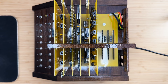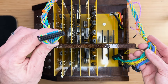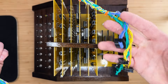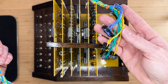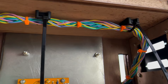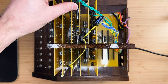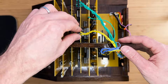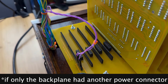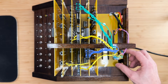The last step is to hook up the switchboard with the connections on the computer. Although I initially considered building an interface board, for now I created a harness using 28-gauge color-coded wires. These wires are very flimsy, so I installed a thick metal wire in the middle to create rigidity. Run the 24-position connector to the inside of the enclosure and connect it to the switch panel; mount it to the side of the enclosure to keep it secure. The purple wires are for power and plug directly into the backplane bus. Notice how the harness is twisted and braided — this is to prevent interference between signal wires.